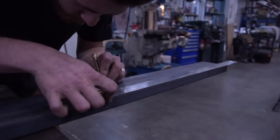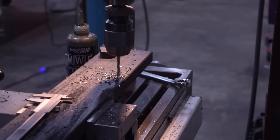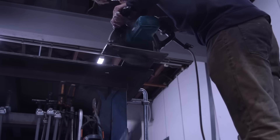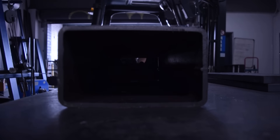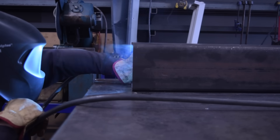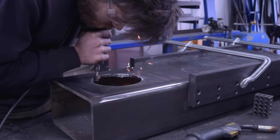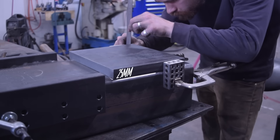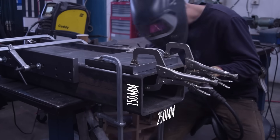Now, I'm not an engineer, but you don't need a degree to know that bigger equals better. The weight of your machine directly affects its resonant frequency, which can have a huge impact on things like surface finish, tool life, and your self-esteem. Likewise, the placement and distance between bearing components will affect the final stiffness of your machine. I tried my best to maximise these aspects of the mill, while at the same time minimising its footprint in relation to its travel. I decided a C-frame configuration built from flat bar and the largest RHS I could get my hands on would give me the best chance of success on all fronts.